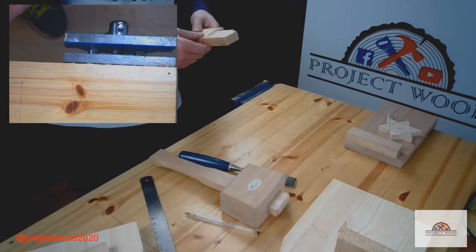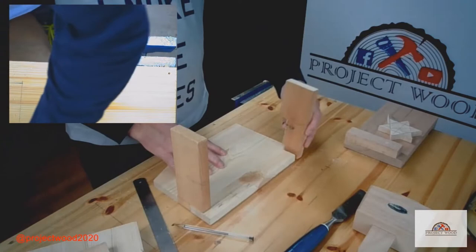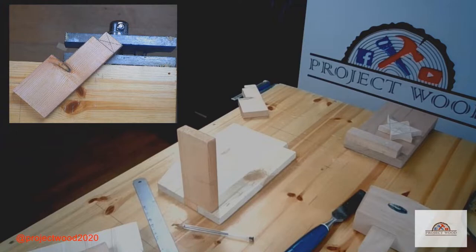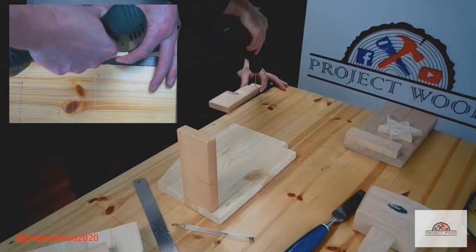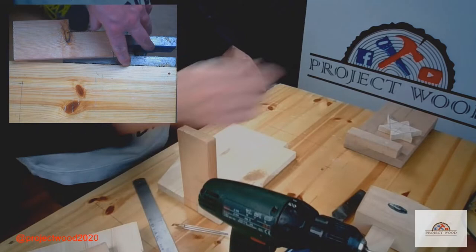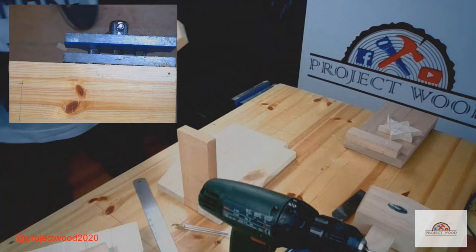It's quite simple. Now that was designed from the outset to have a screw placed on the X mark here. So we'll drill a hole with our pilot bit for that. We'll use a 1.5mm pilot bit. We have a few other holes to drill, so we'll take care of all those. We have the drill in hand. So we'll just be using probably a 4x40 screw here. We'll attach that in there now just to get a look at it.